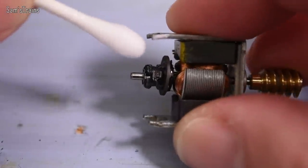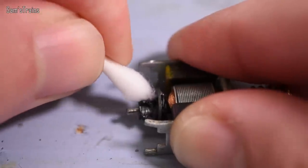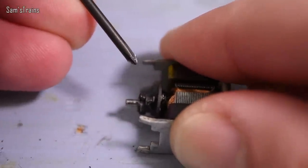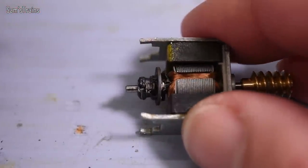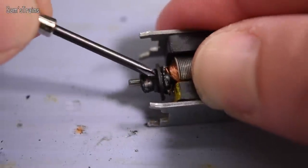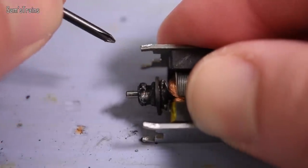I wonder - do you think one of the brushes maybe broke off and shorted something? Because it's very reminiscent of how that Terrier failed. That bit of brush is welded to the commutator - it is not coming off. There must have been some serious current to weld this on. I wouldn't have thought 12 volts at one amp could have done that. That is absolutely tatted - there is no fixing that. It's completely blacked and burnt out.